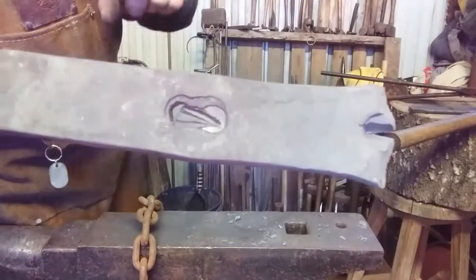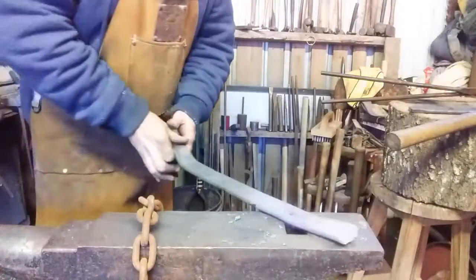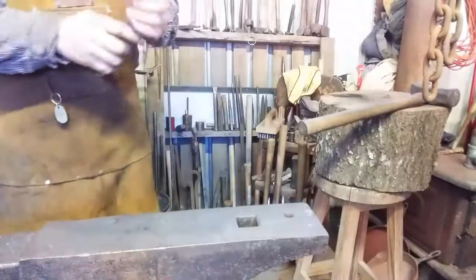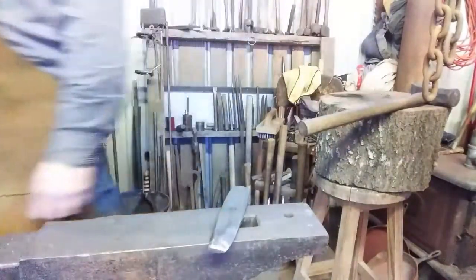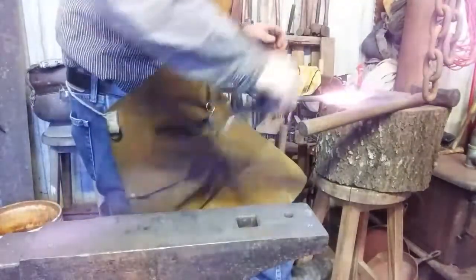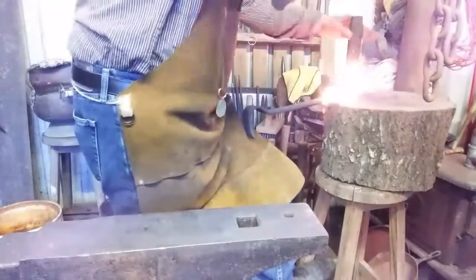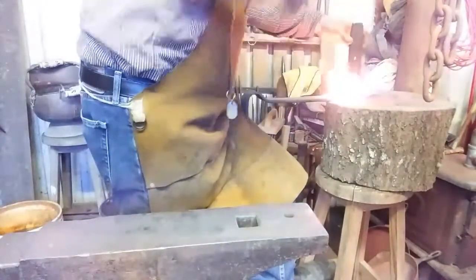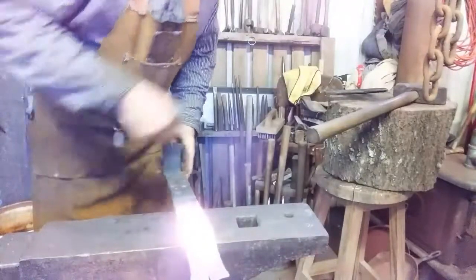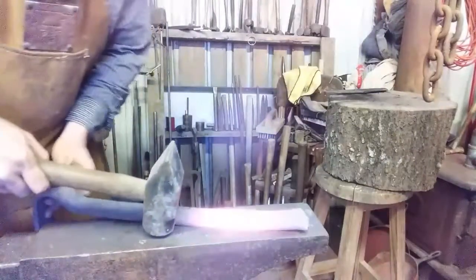Right there at the cleft where the nail head's going to be, I went ahead and thinned that out by punching that impression a little bit deeper. Let's get it hot and punch that hole out. Or try anyway. See you in a minute. Alright, I'm going to try to punch it out on the wood block. Tell one thing right off the bat. Short as that punch is, I'm probably gonna have to wear a glove with it.